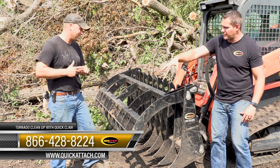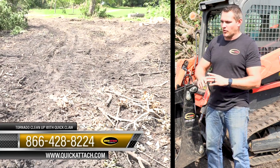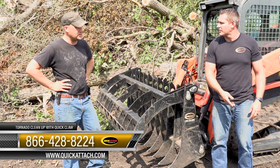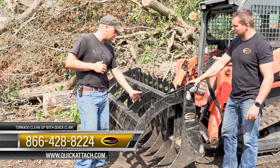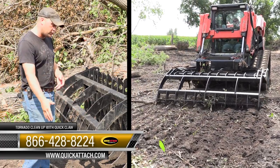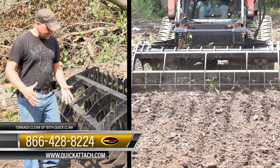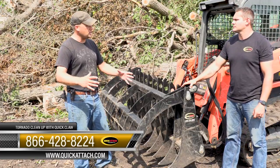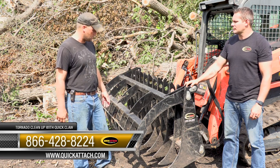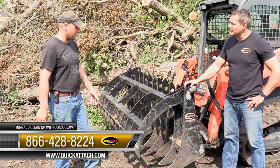You've been back-raking too — where you open the claw all the way up and drag it backwards to clean. Honestly, the ground out here is mostly dirt with just a couple of branches; you've literally cleaned everything up where I could plant a food plot. My salesman was telling me about the back rake — you lift it all the way up, tip it all the way forward, the front tines go down into the ground but the bottom tines stay high enough so they're not dragging. I can put it down into the dirt, back up, and it moves enough dirt that if I'm going over a hole from a stump I've been bouncing through all day, one or two passes fills that hole up. So as valuable as it is to grab material with the claw, back-raking with it is another big plus I really like.